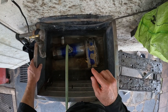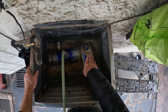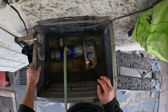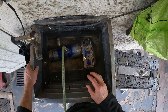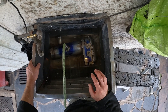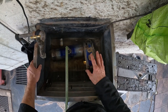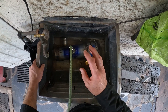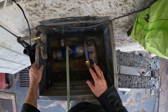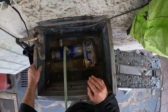One of the main reasons for me first testing on air is if there is any welding repair needed. If there's a little repair on one of the seam welds, then at least the inside of the boiler is not wet. Hydrogen or water in welds is a big, big no-no — you end up with hydrogen embrittlement and all sorts of cracks later on. So if any welding repairs are necessary, it is always good to first pick them up with an air pressure test before you do the hydraulic pressure test. If there is a big problem afterwards with the hydraulic pressure test, you would first need to dry the boiler before doing any welding repairs.